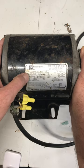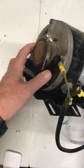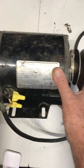If we look at the data plate on this motor, you can see it's a quarter horsepower, 115 volt motor. It's also reversible — to reverse rotation, switch the red and black leads. You would just switch a wire in there and you can reverse the rotation on this motor.